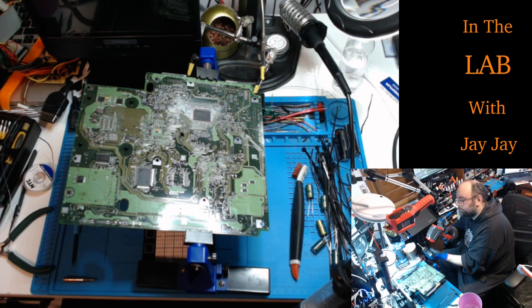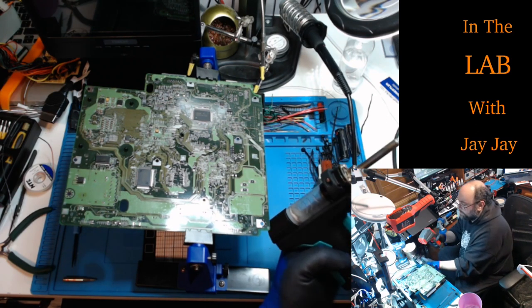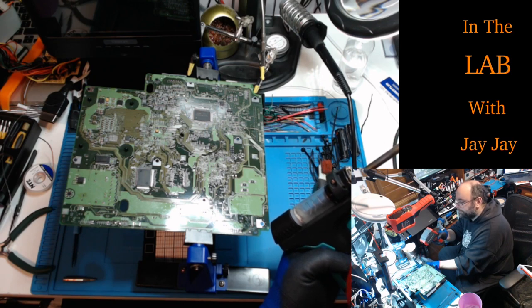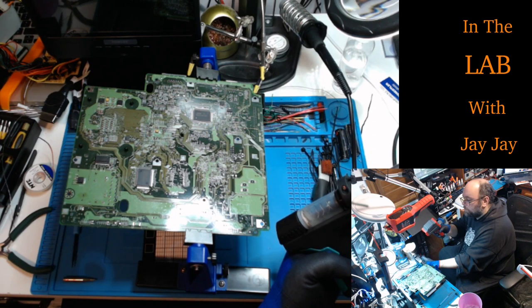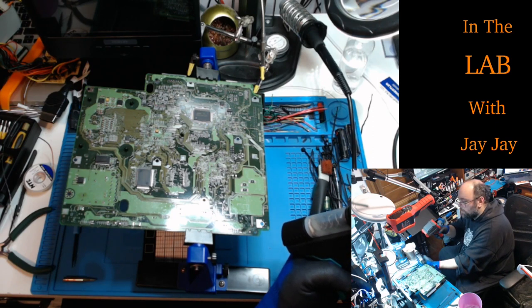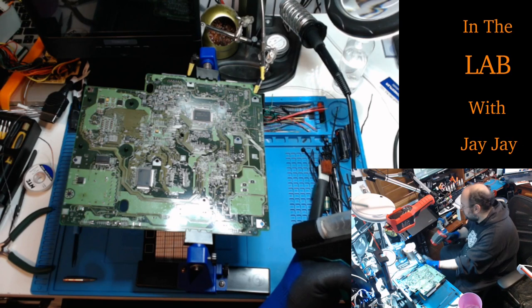It says 150. Alright, I'm gonna put him up to 410 and just see what we can get. That says 150. Oh, 190 we've got. Oh, it's good. It's getting right hot up in the tip. 170, 180, 190. Okay, that's good. I'm pretty happy with that. That's set at 410, and we're getting nearly 200 degrees in the tip, which is hot enough to melt lead.